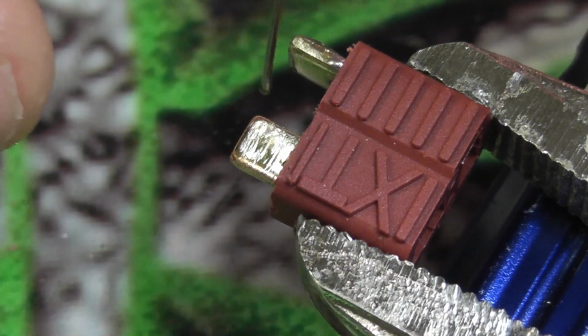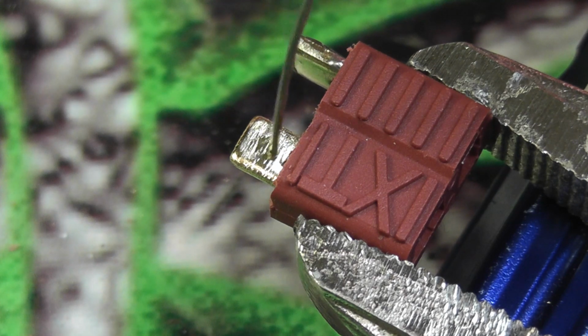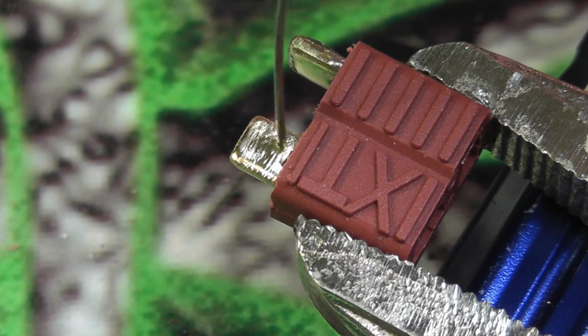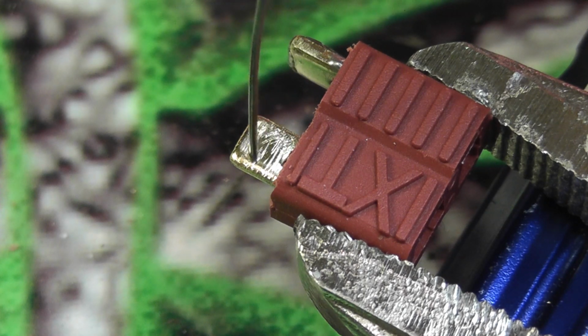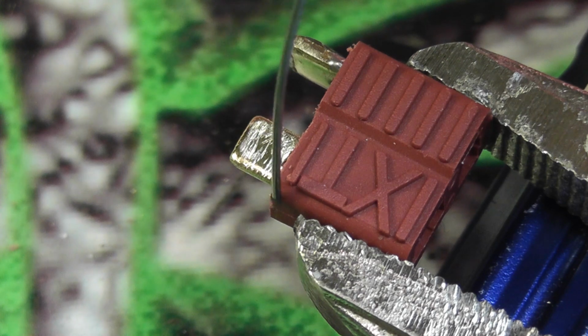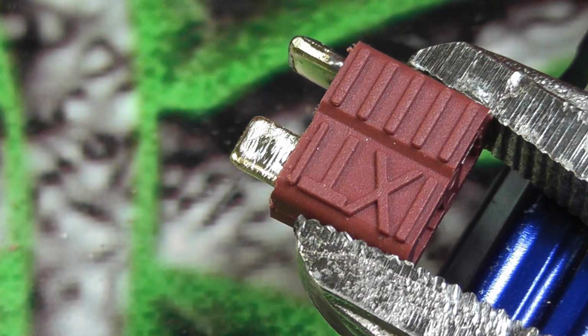And what I'm going to do as the solder pulls up here in this beginning portion of the tab, as it begins to pull up there, I'm going to pull the soldering iron back, and then I'm going to finish pulling solder on all the way out to the end of the tab until I've got a nice little blob of solder that covers the entire tab.